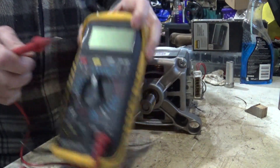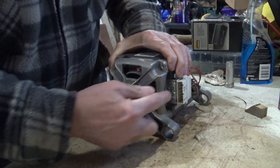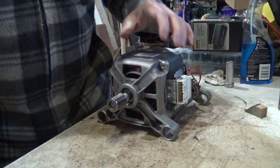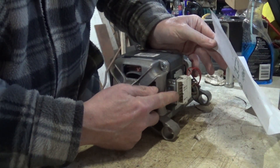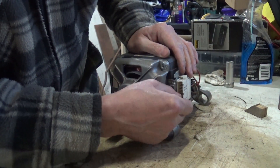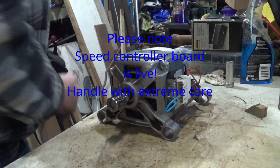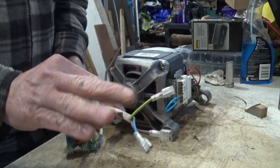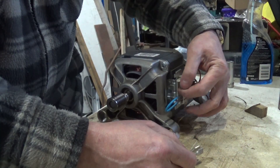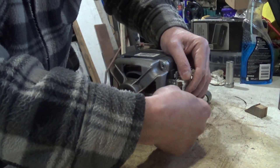Now, the way you connect this up is quite straightforward. You can connect it up either DC or AC — it doesn't really care. But you need power to the field coils and you need power to the armature. You can see that these three are all connected together via the field coils. You can actually short from that field coil there and choose to go on the next one down, which is the top of the armature. I'm going to use my speed controller. It doesn't matter which way round you put the mains, it will spin the same way — it's the relationship between the field coils and the armature that matters. So I'm going to put neutral at the top and live at the bottom.